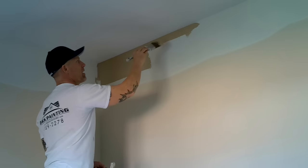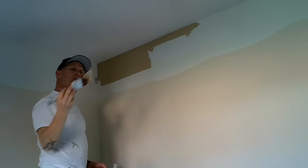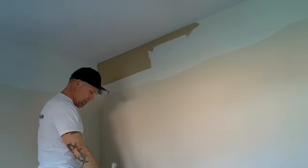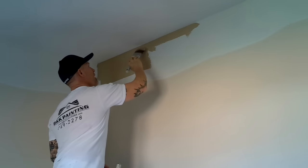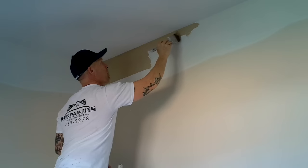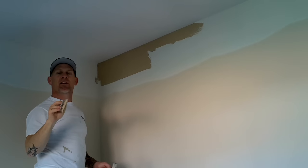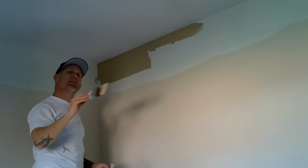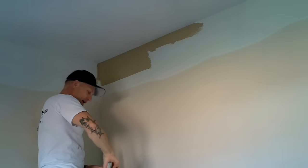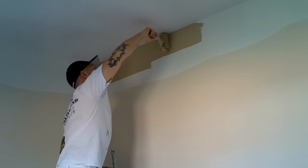Now there are a few little light pinholes and mist spots that the brush didn't get into, because sometimes the brush going one direction will go over the top of some little hills and valleys. So you just load your brush up again and go back the opposite direction. But when you go back the opposite direction to fill in those little pinholes, you don't get near your cut-in. You'll stay about an eighth of an inch away from your cut-in. So now I've got the cut-in done, and I'm going to go back and back roll it.